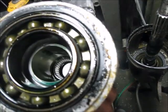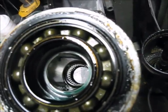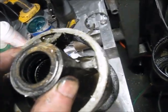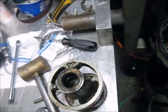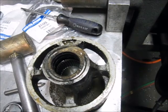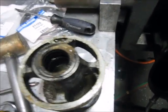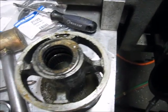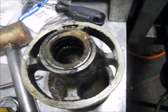You could reach down there - you could use a socket possibly - and it just catches the bearing and pushes the bearing and the two seals out so that you can change the bearing. It's an 1141-0 bearing, I think it's nine dollars and sixty cents - a fairly inexpensive bearing. In this case the bearing had about ten thou play and it should only have two or three, so absolutely we would have to change the bearing.